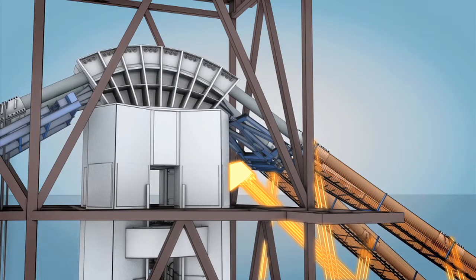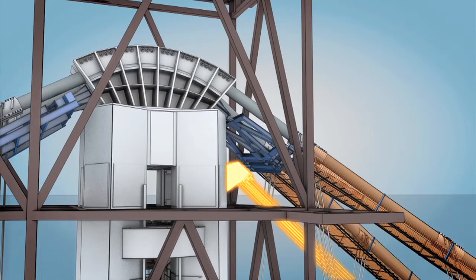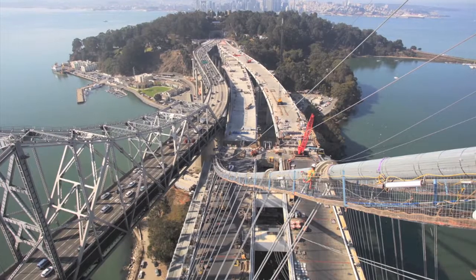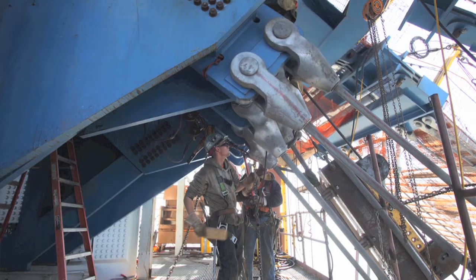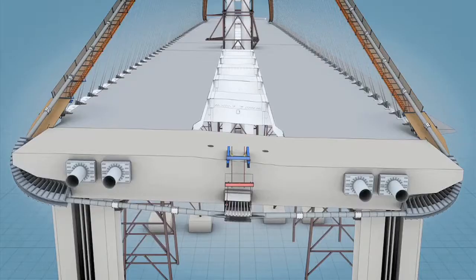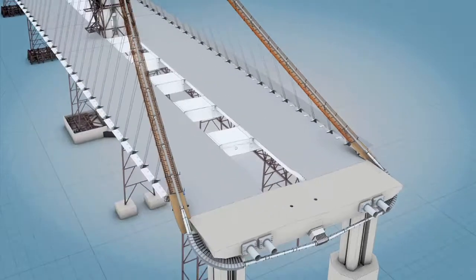So that is the jacking saddle. And then we actually had to pull the main tower out of plumb. As we weighted it, it came back up perpendicular, and these steel strands that we connected to the top of the tower and anchored down at Yerba Buena Island were slacked. We had pulled the tower out of plumb a few inches, and then as the weight was put on, we allowed the tower to go back in. Here you can see cable strands coming down from the tower connecting down to the island, what it looked like on top of the tower, and how they were secured to the tower top. Here they are slacked after we've released them. Now the main parts of load transfer are complete, and we can start putting the hardware where it needs to go on the bridge.